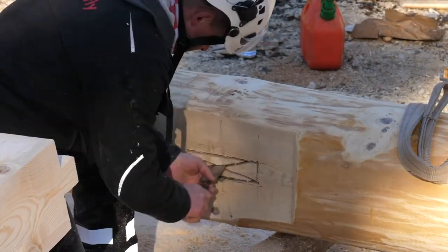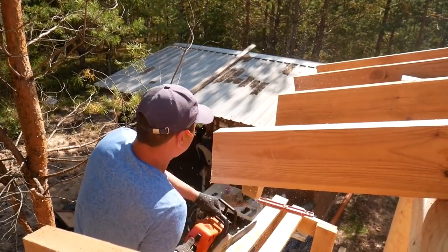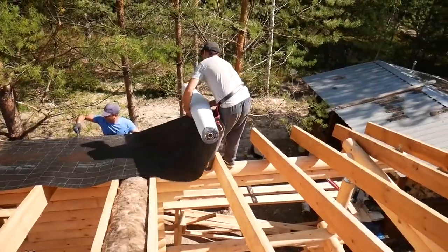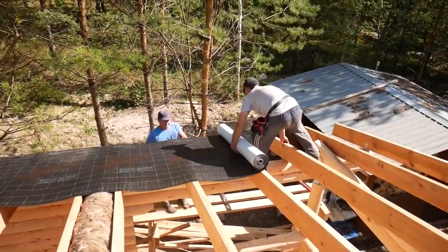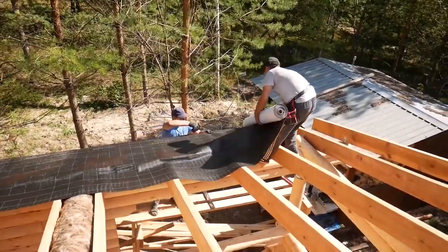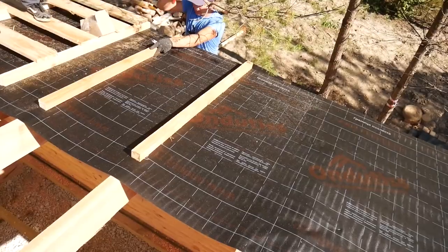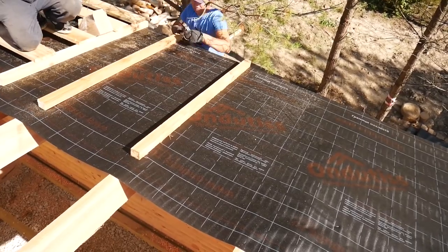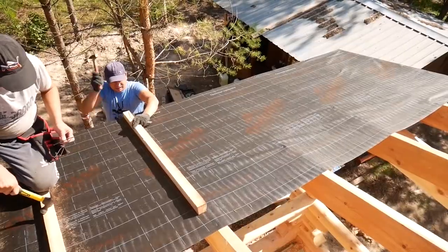Once the rafters are installed, we can start to add the sheathing using 20mm or 4/5 inch boards. The sheathing can be hammered together with nails. But first, you need to firmly attach the waterproof cover. First using a stapler gun, then adding the timber on top of the rafters. The sheathing is attached to said timber. That's the best way to achieve a fully waterproof roof.